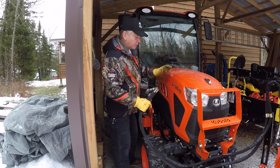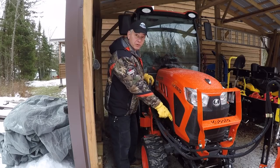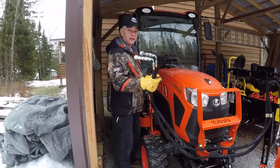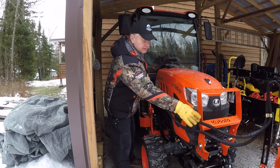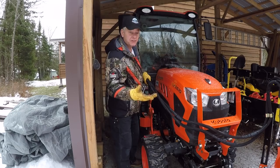You folks probably remember when I installed the snowblower — the main blower hoses were long enough that they could route underneath where they're supposed to and come up to the valve body. But the chute deflector hoses, similar to the last blower I had, are much shorter, and they won't route through. So I had these tie-wrapped up to my grill guard, same as I did last year with the B2601.